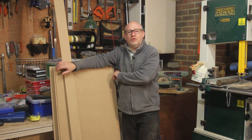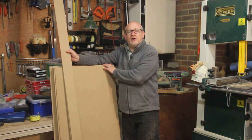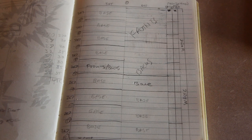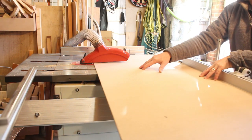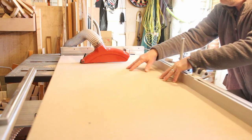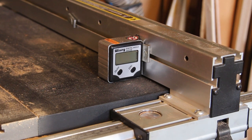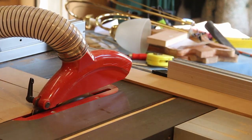I'm going to cut them down precisely on the table saw and these pieces will make the fronts, the bases and the backs of my parts trays. These two long pieces will be used to make most of the sides of my parts trays. I'm being guided by a cutting list that I sketched out in my notepad. The idea is I want to cut all of the things to the same size together so that I only have to move the fence once for each size of cut — that way everything will be identical. To prevent the work from getting trapped between the fence and the blade when I'm using the sliding table, I'm using my little magnetic inclinometer as a stop block, so I'll push the wood up to that to make my cuts and use that as a reference so that everything's exactly the same size.